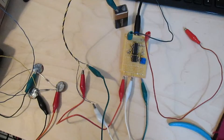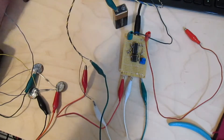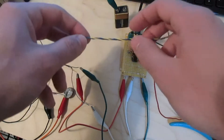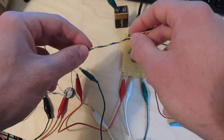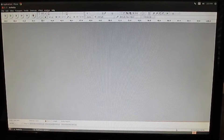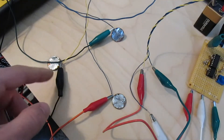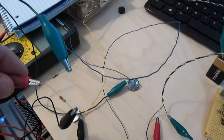For now I want to get rid of that radio noise. This looks like a big mess, but really it's just the original electrode cable that I've been using. Instead of connecting it to my body, I have 1 megaohm resistors between each signal electrode and ground. The other ends of these alligator clips aren't hooked up to anything — they're just there to hold the resistors on. Since the wires are wound nice and tightly together, there's no loop between them to pick up any RF noise as a loop antenna, which means hopefully I shouldn't have as much differential RF noise at the input. Now I've clipped the alligator clips onto the little bit of bare wire in front of the penny instead of onto the penny, and that has improved things a little bit.